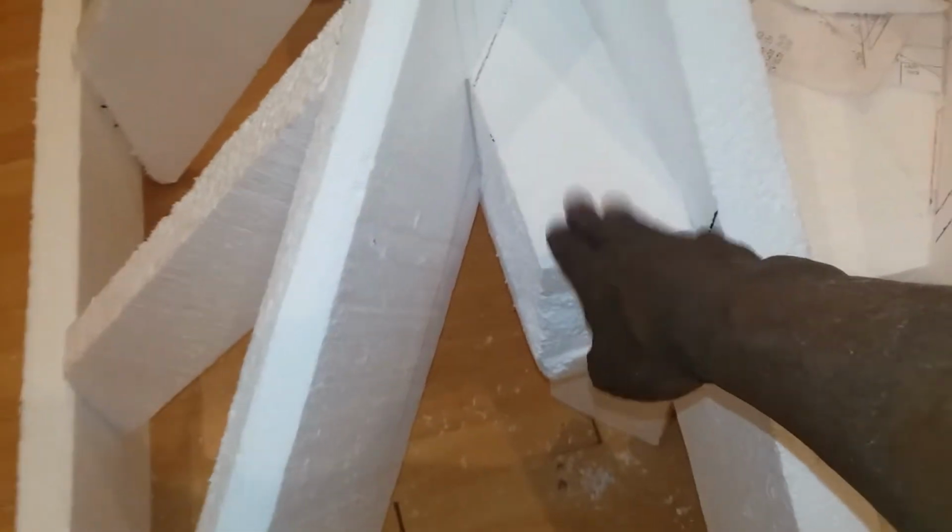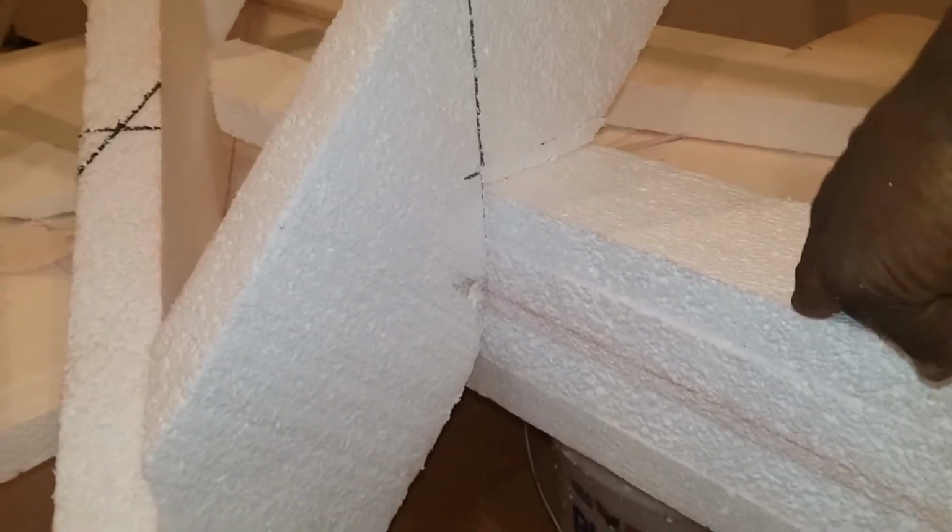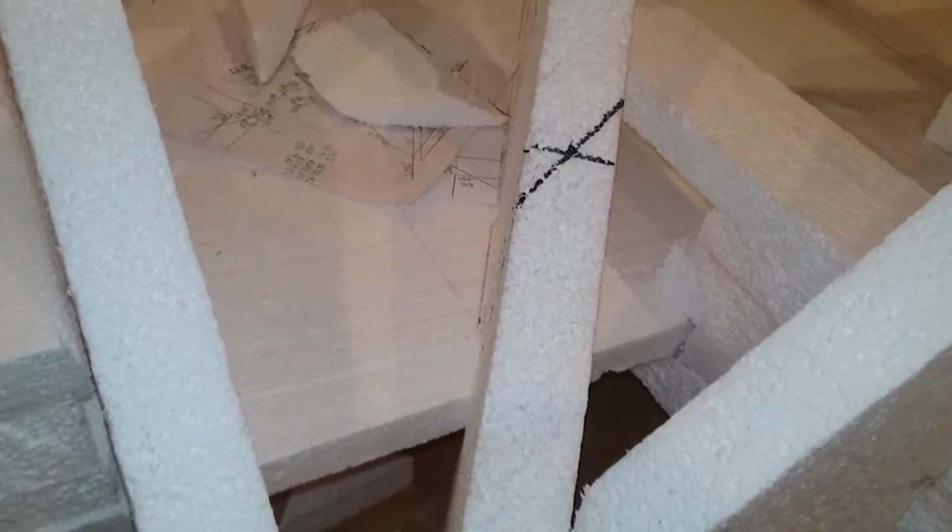So yeah. You got your valley jacks in here, all nice and beautiful. Look how they line up and parallel and everything. And you can see here on the 12-12 side, it's built up 5 inches. But on the 8-12 side, it's going right to the top plate. This right here represents the top plate that the ceiling joists sit on. That's what this represents. Okay?